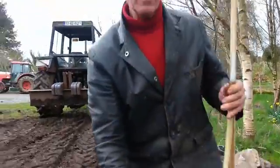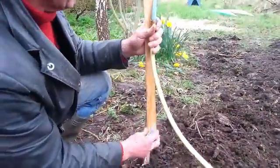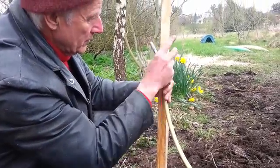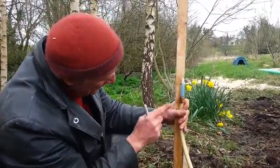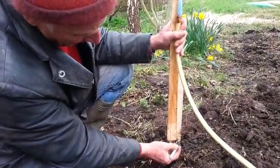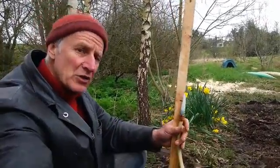And I'll come back down here and I'll do the same thing. Now you can see this is much higher already, and I've got a bit of work to do. See, this level here is always the same as that level in the bucket — so this is my reference, that level there. I'll put my mark there, right there. And I'll do the same over there. Then my level lines give me an idea of where to actually push the dirt.